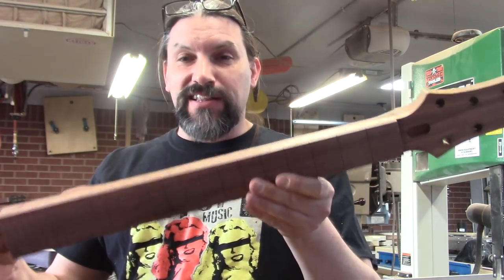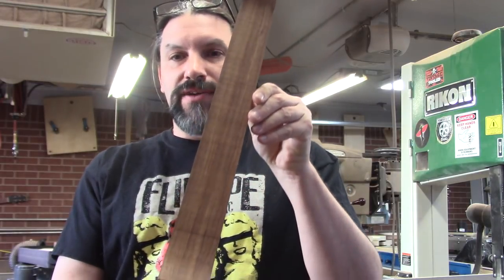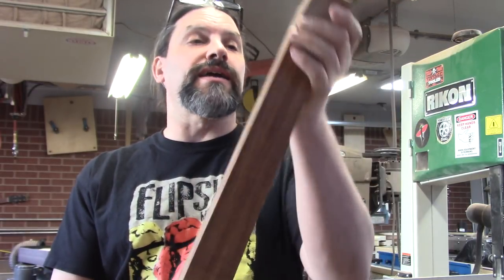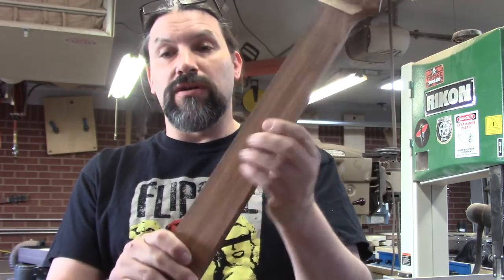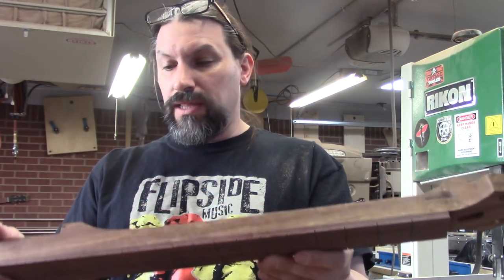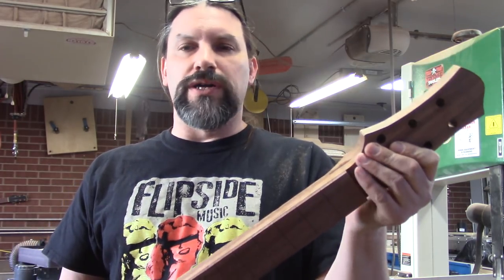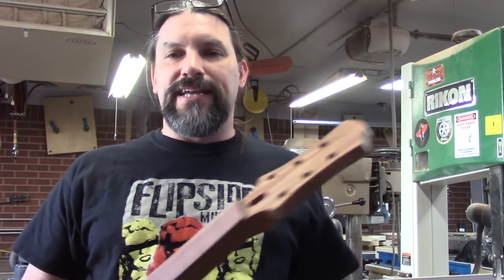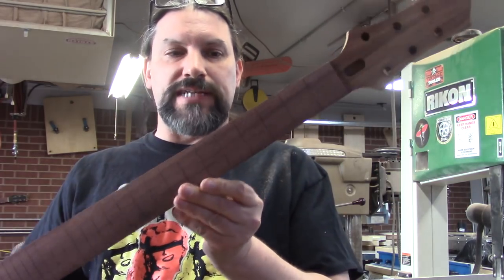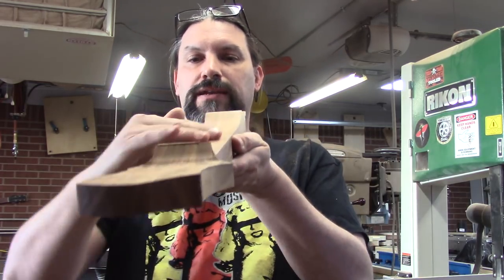This neck is finally starting to feel a little more like a guitar neck — it's not so ridiculously heavy now. Check out the grain pattern on this one; it's going to be a really cool neck and probably worth all the hassle. The Chechen is really good wood to work with — it saws pretty easily. It's not mahogany, but if you have your bandsaw set up to do this, make sure your tension is right and the blade is sharp, because what can happen is your blade can start to wiggle and wobble and you won't get a nice even cut.